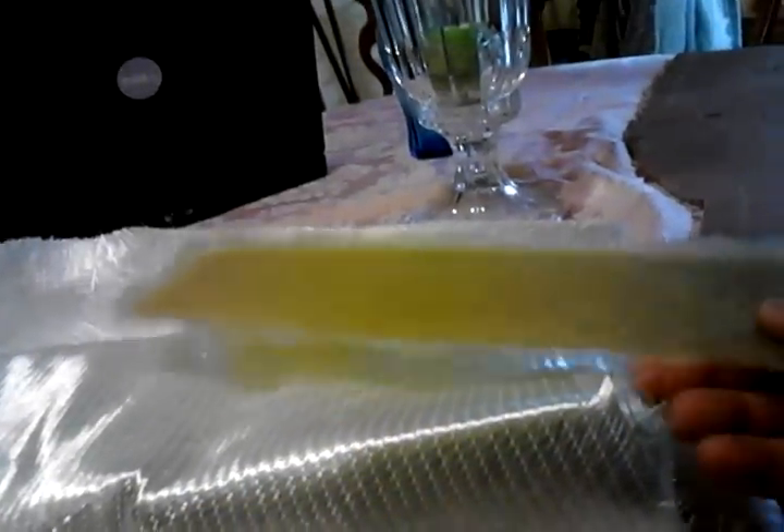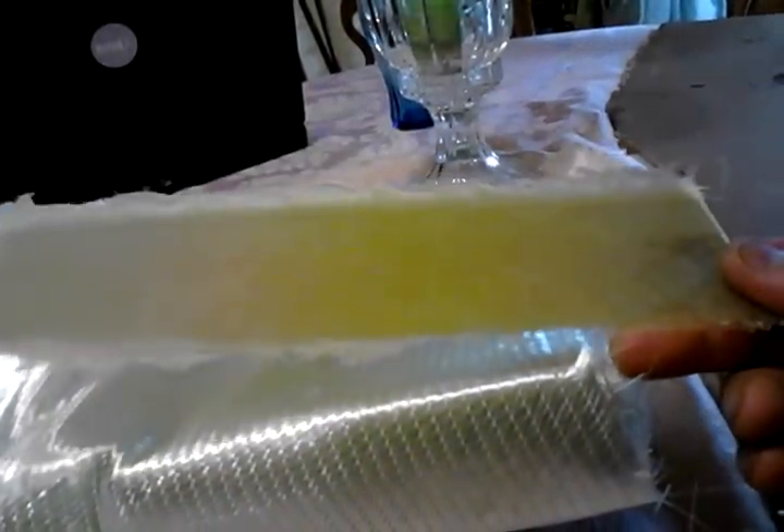Short video to explain how I am going to lay up the inside transom. I laid up this test piece when I got home from work and laid it up on a waxed piece of hardboard I used for a form. I waxed it up and it released real nice. That was one of the tests to see how well it released, that it didn't adhere or soak in, and it popped right off.